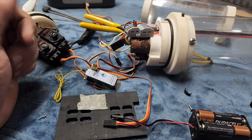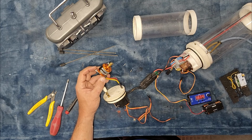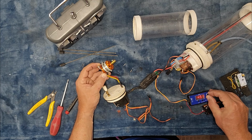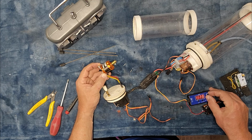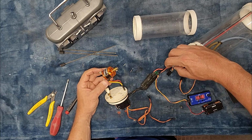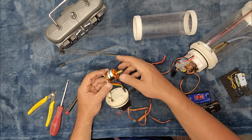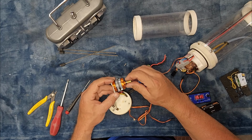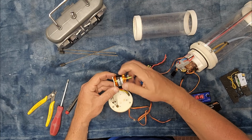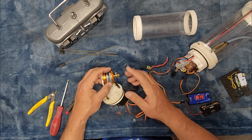I threw power on the pumps. The pumps are actually working, and they have really good suction through the intake. I'll be snookered. The speed controller is working. The reason the motor wasn't working is because I have a hunch it was never, ever maintained. The bushings, the bearings were seized up. I just worked it, I lubricated it, and now it's completely fine. So there you go. Brushless motors in the wet. You can abuse them, and they'll just keep on ticking.